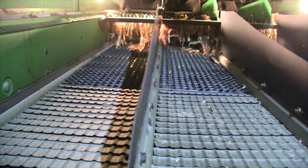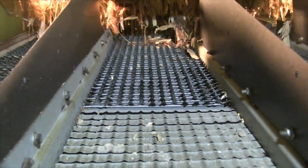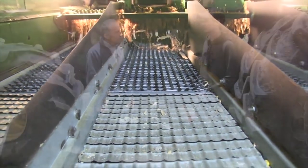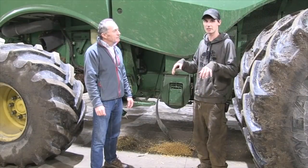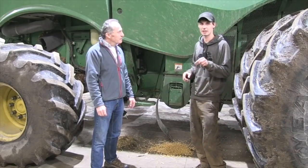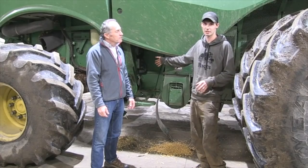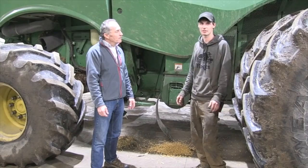When you're dealing with DON, you close that back section and turn your airflow all the way up. That creates a garden hose effect — like putting your finger over a garden hose so it sprays harder. Any corn that comes down — and the smaller kernels are what you want to get rid of — drops to the sieves, and the increased airflow pushes it to the back of the sieves and out. Closing it allows more airflow up through your sieve and chaffer.